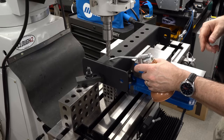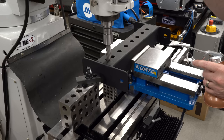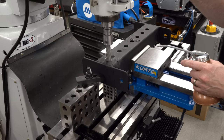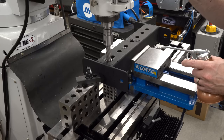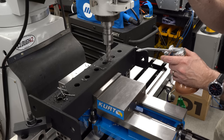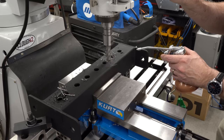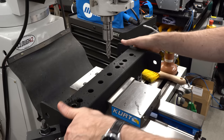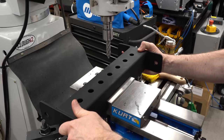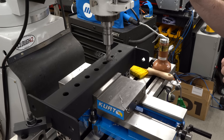Use a little bit of cutting oil here and we're running this nice and slow. Just apply pressure and let it cut. These bits do a beautiful job on thin metal as long as you can hold it securely, because they don't grab and try to screw their way through like a normal drill can. Once you push it all the way through, the ejector pin generally pushes out the slug. It just ejected the slug down inside the tube. Now we'll just flip it over and make the same holes on the other side. These side holes through the side of the cross member are only needed for the top cross member because that's where the pulley system is going to mount.